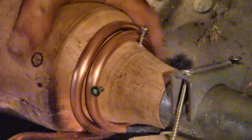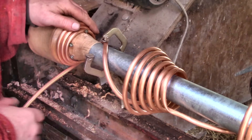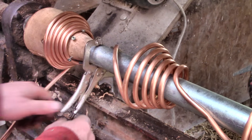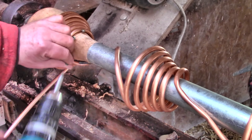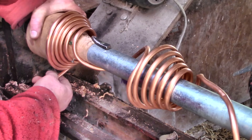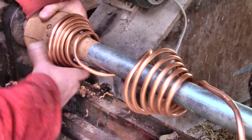I started again using a mandrel that I turned on the lathe from a piece of firewood. I had to make a special shaped metal guide to help the tube around the tightest turn, and after that it went okay — slow but okay. I couldn't get the spirals very close to each other and the whole thing needed supporting all the time. It came pretty close to kinking a few times, so it was slow and frustrating.